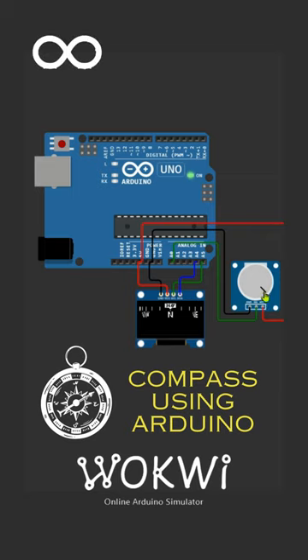I'm using the Arduino Uno, the 10K potentiometer and this OLED display. It's the SSD1306 — that's the driver chip being used inside this display, connected using the I2C connection, so we only need 2 wires for the data and 4 wires in total. The resolution of the display is 128 by 32 pixels.